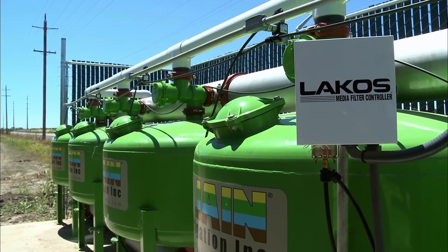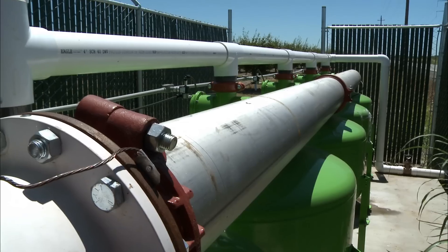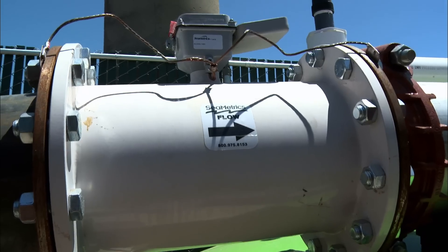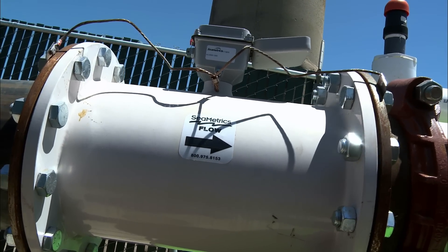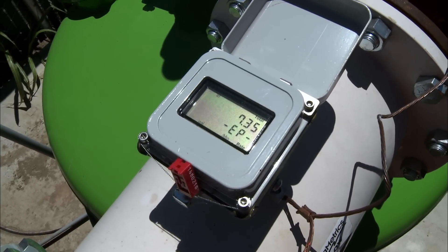The three most common types of flow meters are propeller flow meters, which have a little arm and a propeller that stick inside the pipe and rotate with the flow; electromagnetic flow meters, which may or may not have a projection into the pipe and sense the charge of the water as it moves past; and ultrasonic flow meters, which send a sound wave through the water and measure the shift in that sound using the Doppler effect.